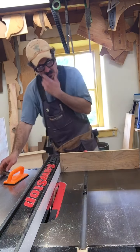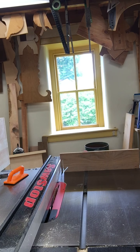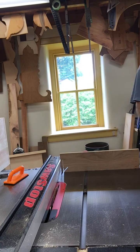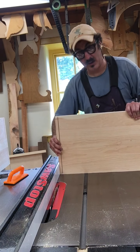So I'm just going to cut those faces again where they have to go back to. If my tenon doesn't run all the way to the front there, it gives me a little bit of give to get it perfectly flush and that's what I want. I can be off by a 32nd here and it's not going to make a difference.